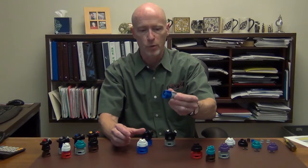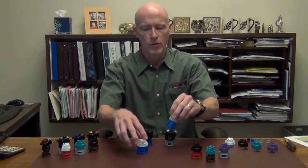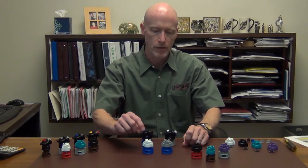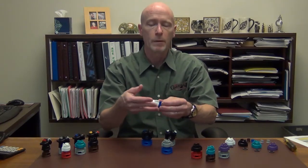If you're familiar with our original TDXL, the tip cap on the end of the original TDXL is gray, which is a 6. So it's exactly double the size of the flow rate. So these are both 3s, but one has a 6 pattern tip and one has an 8 pattern tip. And that creates more internal pressure drop, gives us the bigger droplet, helps us get to that ultra coarse droplet size category that's needed for the dicamba type formulations.